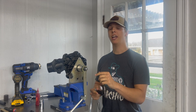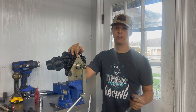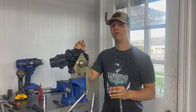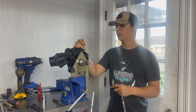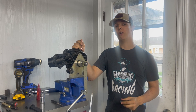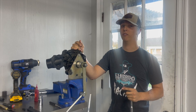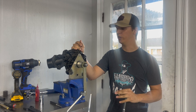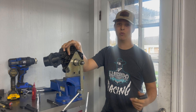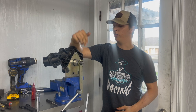We're now ready to set the slip on this supercharger. How you set your slip and how often really depends on your particular Sea-Doo and the way you ride it. If you're riding a stock 300 Sea-Doo and never really beating on it hard, pull the supercharger every 100 hours and set the slip to around 12 to 13 foot-pounds. If you have a modified Sea-Doo with a stock supercharger and beat on it a lot, you probably want to set the slip a little higher in the 13 to 14 pound range and do it more often. Modified superchargers — a typical rule of thumb we've been saying for years is you need one pound of slip for every pound of boost you make. On the big superchargers you do not want to do that; this particular one is going to make over 20 pounds of boost with the aftermarket impeller and we do not want to set the slip to 20-something pounds — if you do it too high you run the risk of breaking gears and shafts.